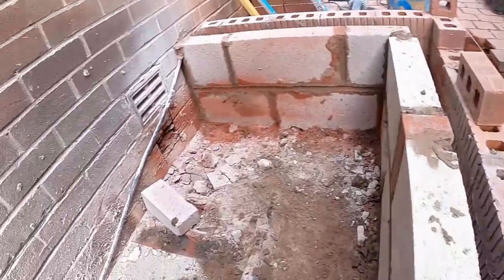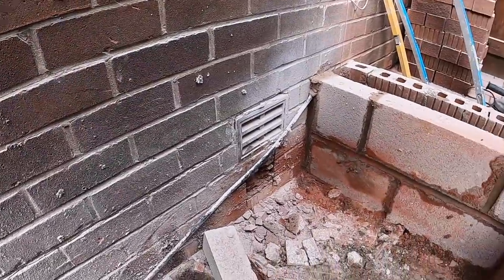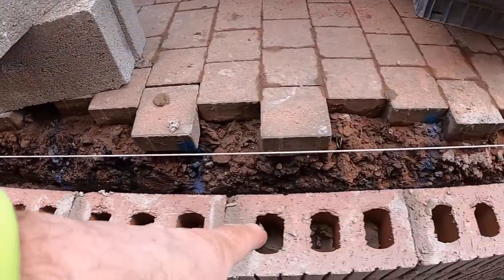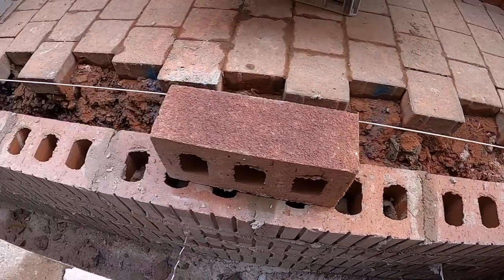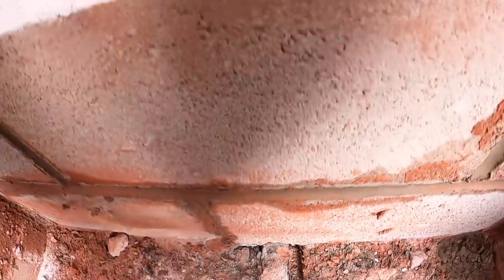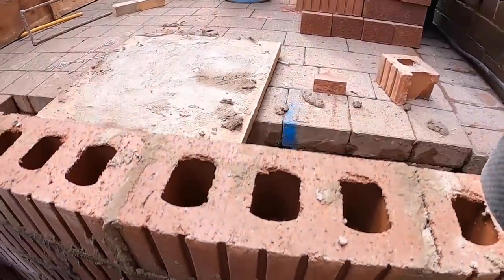Same here, I just need to cut that out before we go. And then obviously we're putting two pipes in, there's only one. We're only covering one vent, or one and a half vents. So we're putting two vents in to make sure it's well ventilated. And then plastic vents on the top. Then these vents are going to vent all this cavity, because this is all going to be open. Insulation starts there. So you've got all this open, then you've got two pipes, so that's plenty. We've cut round the gas pipe, so we're not sat on it. So it's all clear, same there.